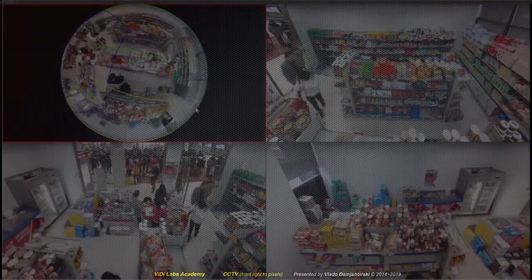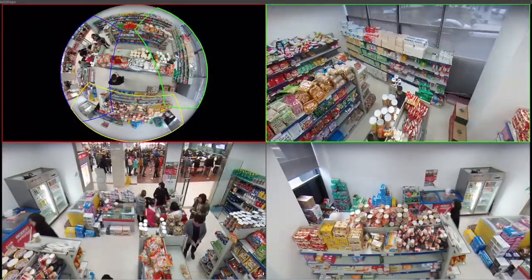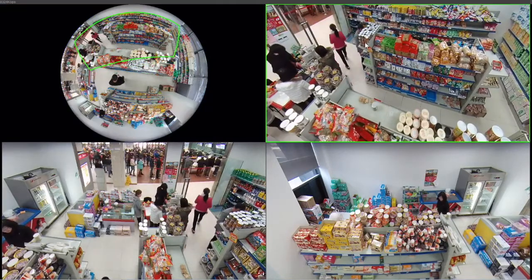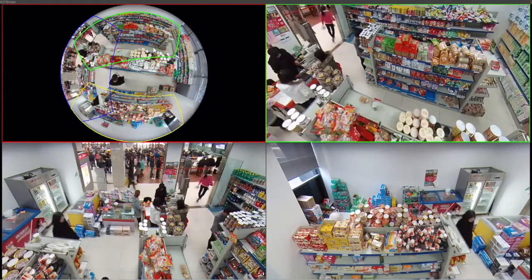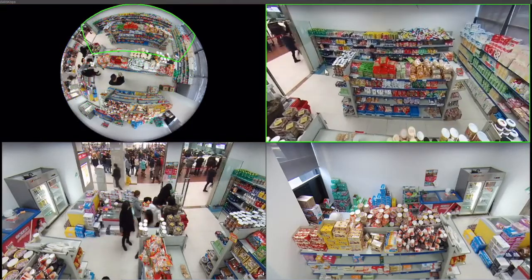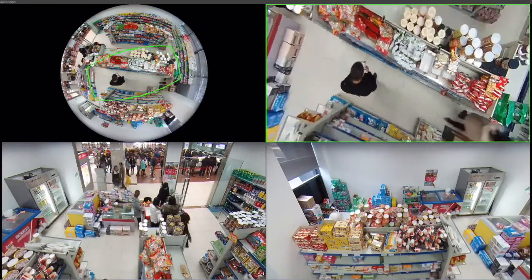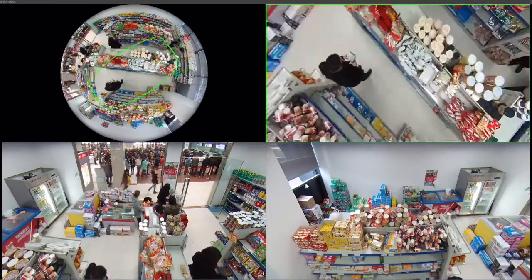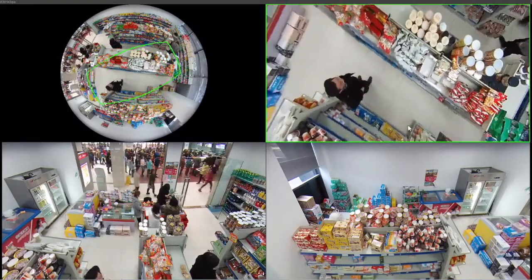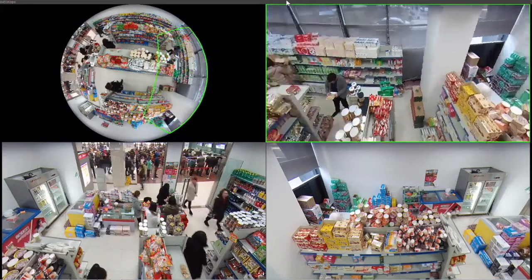The difference is in CCTV, in order to view the scene properly, we use a so-called de-warping software, which straightens or de-warps the distorted view, especially near the edges, and makes the fisheye lens appear normal or natural to us. In fact, to some installers, it seems that a fisheye camera can replace a few fixed cameras looking in different directions from the same point.